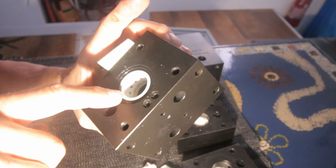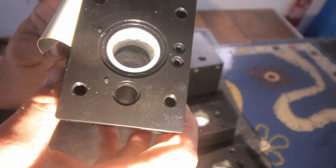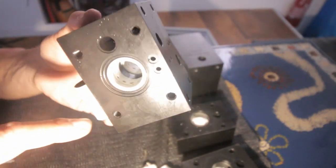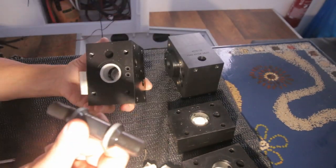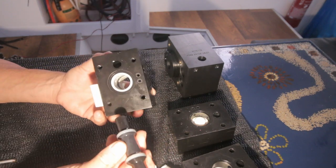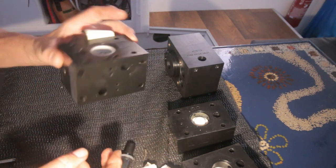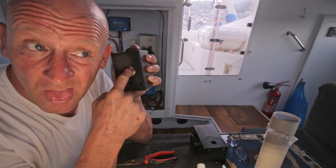You can see that this water maker hasn't been used for way too long. I don't know if you see it on camera, but there's a black kind of rim in the back of the annular ring, and here at this side it's at the front. So this reversing spool valve has been sitting on this side for a long time. I think I remember the previous owner said he didn't use it for 2 years, but it's just dirt and no damage.